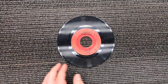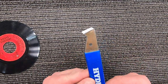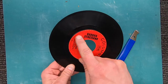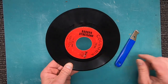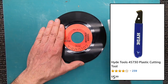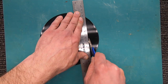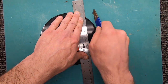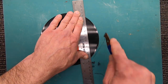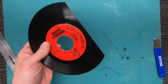Alright, this will be quick. Here's a tool I bought for cutting clear acrylic panels. It has a sharp point on the back end. It's an inexpensive tool available at most hardware stores or Amazon — but then what isn't available from Amazon? You don't want to cut on the label; that center section is thicker. I cut about three-eighths of an inch away from the center at the top of each label. Once you score it about five to ten times, it snaps off easily and cleanly.